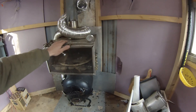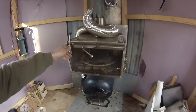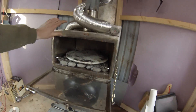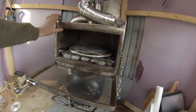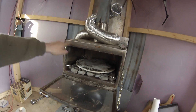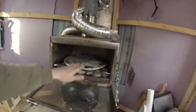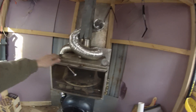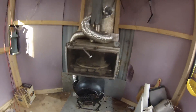The second feature on this stove is the pizza oven. I have a temperature gauge here and a glass door so you can see what's cooking. It's a homemade chimney-style oven — double walled all the way around. Smoke flows into the bottom and around the outside of the oven and up the top, heating up the pizza stone and everything inside. You can get it up to 400 degrees in here no problem, which is perfect for cooking pizza. Just a weird little latch mechanism on this one, but this is what keeps us warm and fed in the winter.